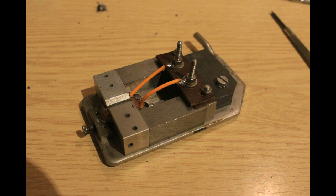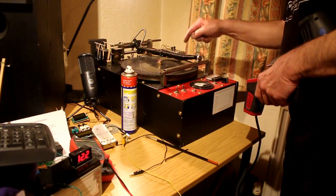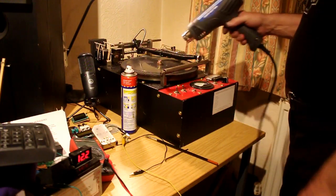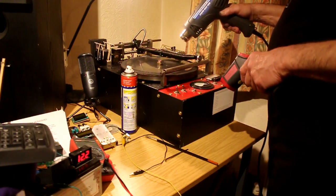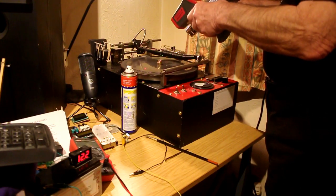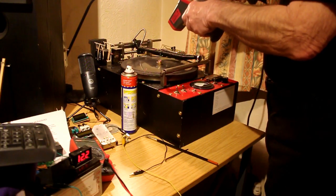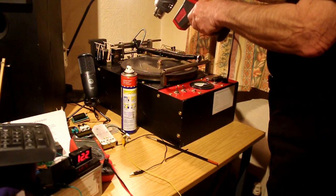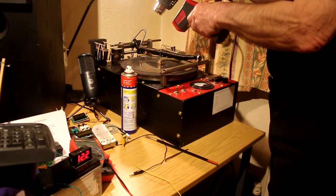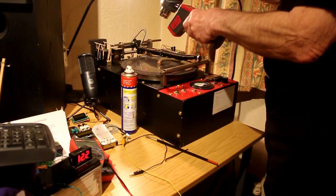Will it work? We're now going to try out this head. We're going to try it on a polycarbonate disc which has been coated with WD-40. We're going to warm it up with a heat gun and measure the temperature with a laser pyrometer. We reckon if we're getting up to about 45 degrees centigrade, something like that is going to cut better. Listen to the results, if any.